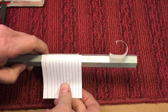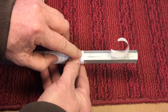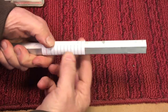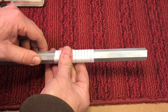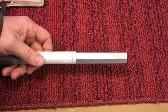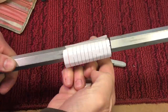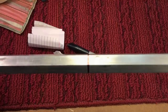What we're going to do is place it here with a piece of tape to hold one section down, then wrap the card stock around until it matches up perfectly — it's got to match up perfectly on this side. Once it's matched up, take another piece of tape and put it down to secure that. Now you have a line that goes all the way around. Trace that with a sharpie — that'll transfer the line onto here. You can also slip this up and down a little bit to whatever size you wanted. Once you trace the line, you just rip this off and you'll have a perfect line all the way around. You can do this on round stock or, as you can see, hexagon.